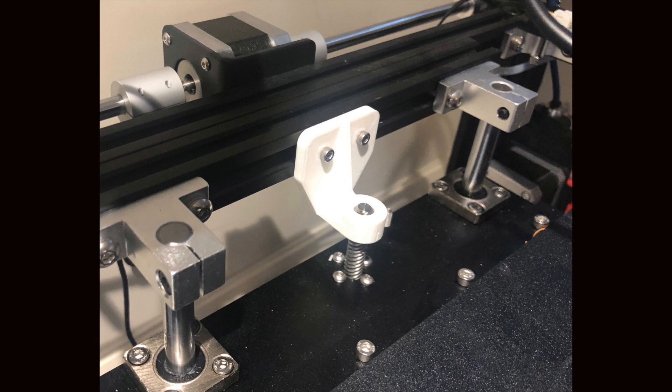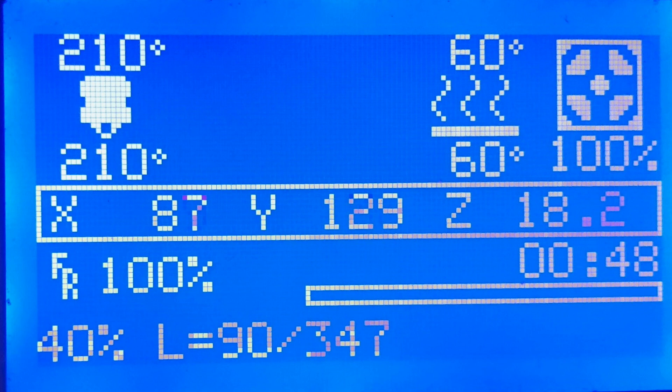Finally, I have a small part from Thingiverse — I'll include a link below — that holds the Z screw more stable, meaning even less movement of the print bed. A side effect is it also prevents the print bed from falling when you turn off the power on the Ender 5. And when you print faster, you need higher temperatures because you're pushing more filament and need to ensure the plastic stays at temperature. I'm printing MatterHacker's Build Series PLA at 210 degrees Celsius.